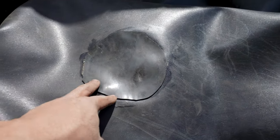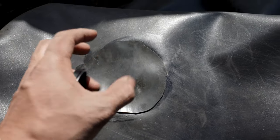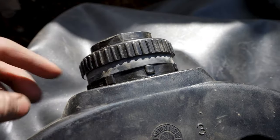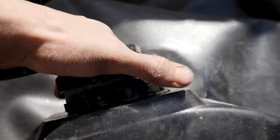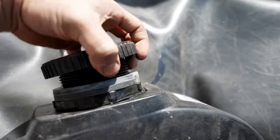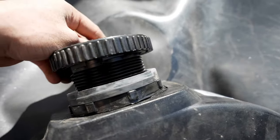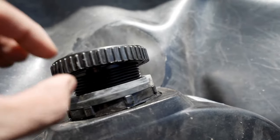If you're looking for a video on how to seam liner or patch any holes in your liner, this is not that video — this is more about the process of building a waterfall. This is just an added layer of protection by doing the bulkhead. How the bulkhead works is you have these two rubber gaskets, and it is a reverse thread bulkhead. We're going to cut a hole in the liner the same diameter as this bulkhead — one gasket goes inside the liner, one goes outside — and then we tighten it to create a compression fitting that seals the water and makes it watertight so we don't leak.